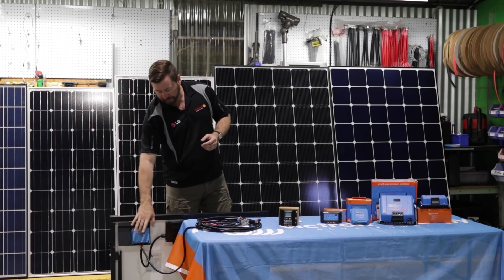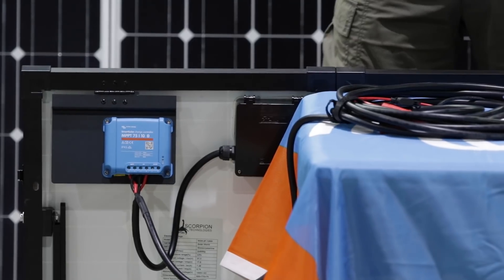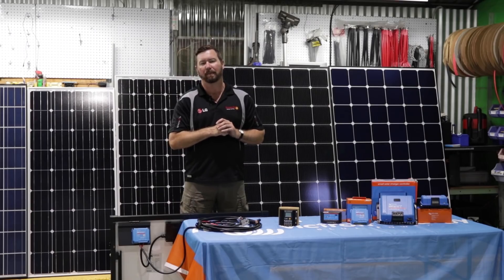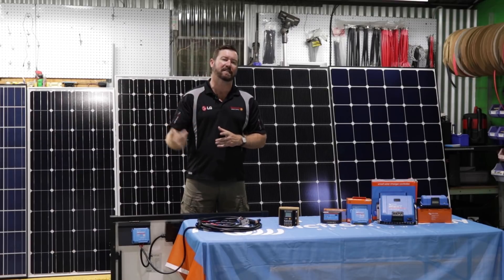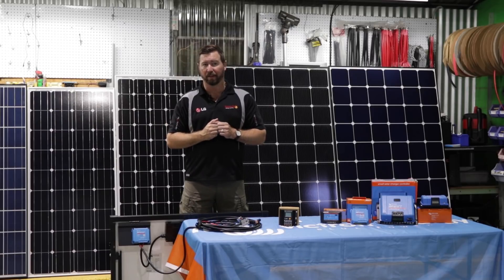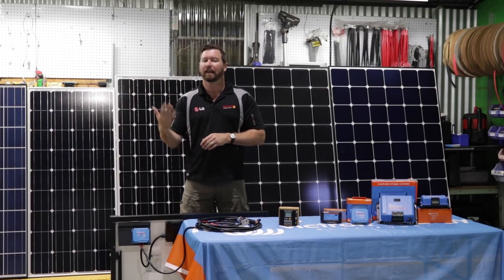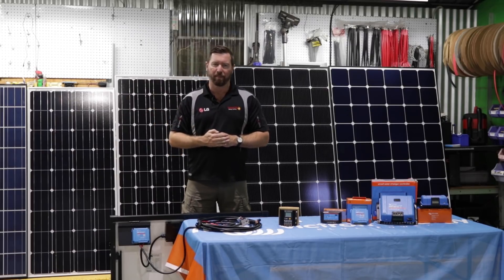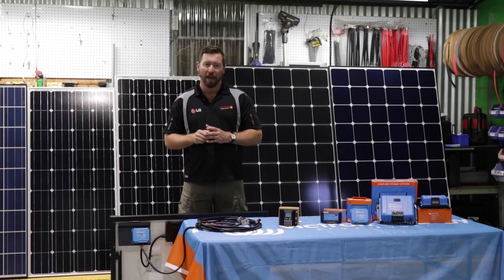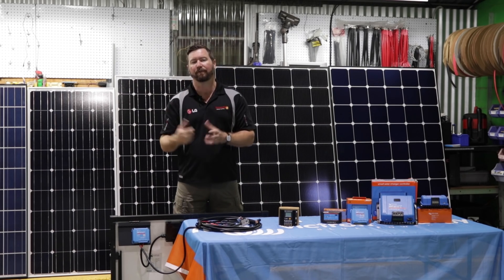On our portable solar panels, again smart controllers — this one is Bluetooth compatible and an MPPT regulator. It allows us to harvest more energy from a small solar setup and we can connect to it to see what it's doing and the energy out of that system. It also allows us to track the sun a little bit — if we want to see where we're getting highest performance from our panels, get the phone out, look at the wattage, and move the panel around to find the optimum angle and optimum azimuth for our sun.